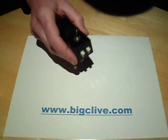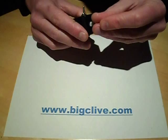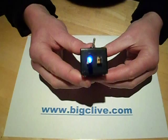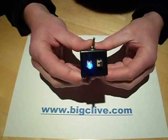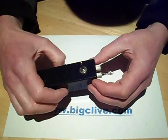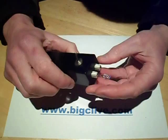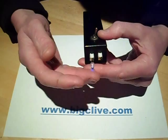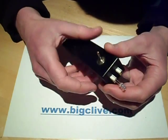But there's another feature. The channel that's off also has a trickle current going through it of just five microamps. That's just barely enough to make an LED glow. But it's very useful because with the early gallium nitride LEDs, you tend to have quite a high failure rate from the standard packs that you got from China. And by testing them at five microamps, if you plugged it in and the LED lit, then it was probably going to be pretty reliable.